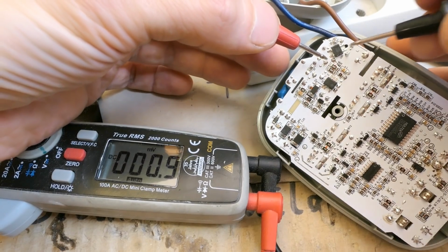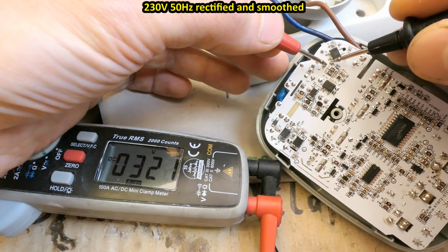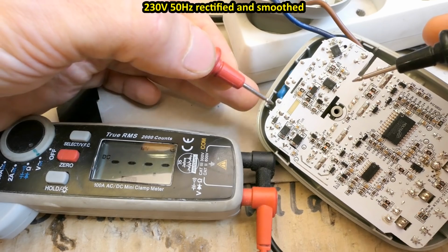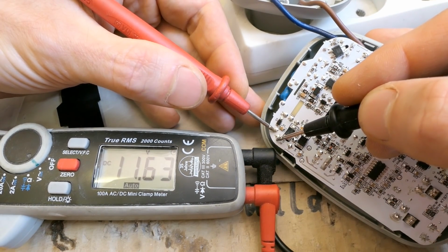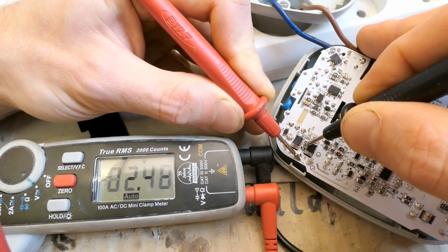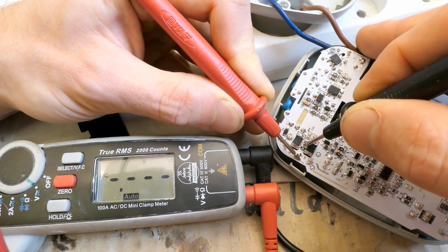Now let's try to do some measurements. Here should be the rectified mains on the primary smoothing capacitor, about 320 volts DC. And the secondary voltages are... One of the capacitors seems to be nearly 12 volts, and the other one is... It actually keeps changing. So it's probably the charging voltage for the batteries, and...